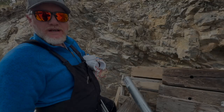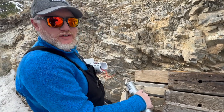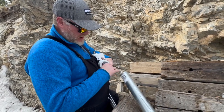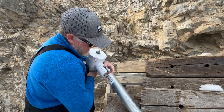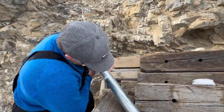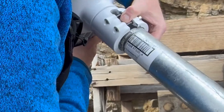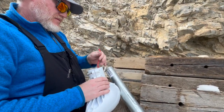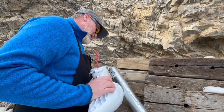The snow is killing me — it's coming. We bought a two-inch diameter steel pipe according to the directions from Pikasola, but that is too large. It really should be about an inch and a half, maybe inch and three-quarters tops. So that is not going to fit on this pipe no matter how much I want it to. I'm either going to have to replace the pipe or somehow grind it down in size.